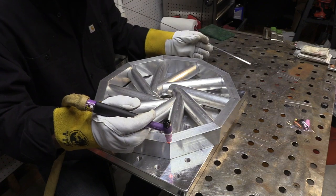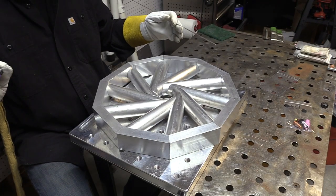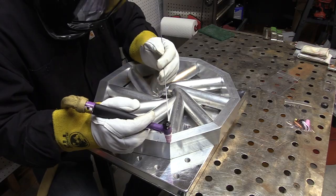I'm using a tapered electrode for these tacks. I just sharpened it like I would for thick steel with a fairly blunt taper, and then just tack. We get a nice crisp start that way. It's very easy to control the arc, and the arc doesn't wander nearly as much on a nicely sharpened tip like this, even on aluminum.